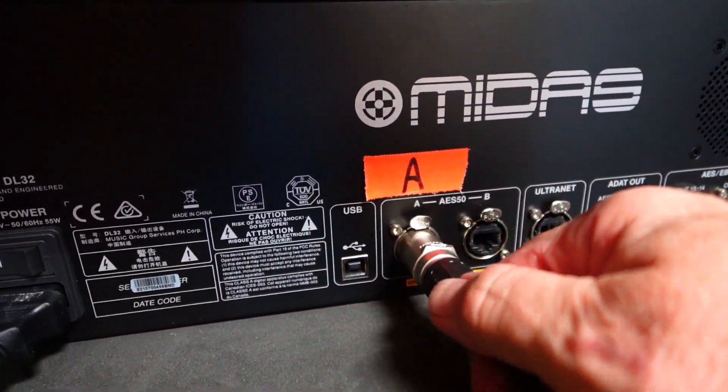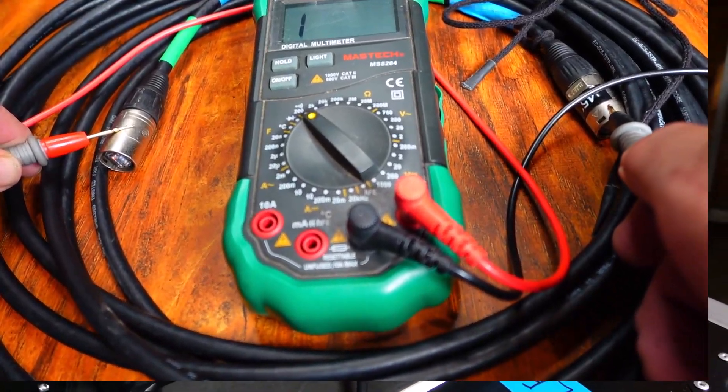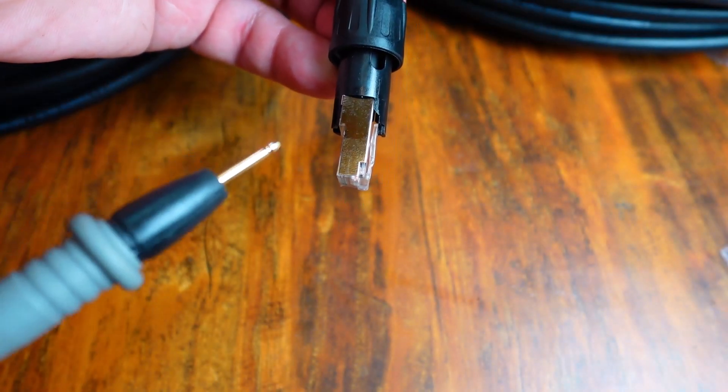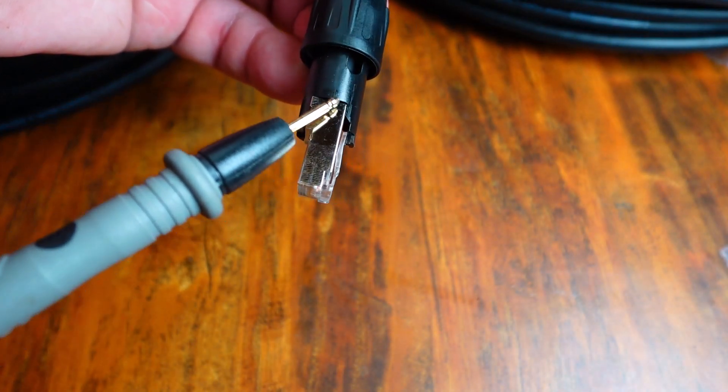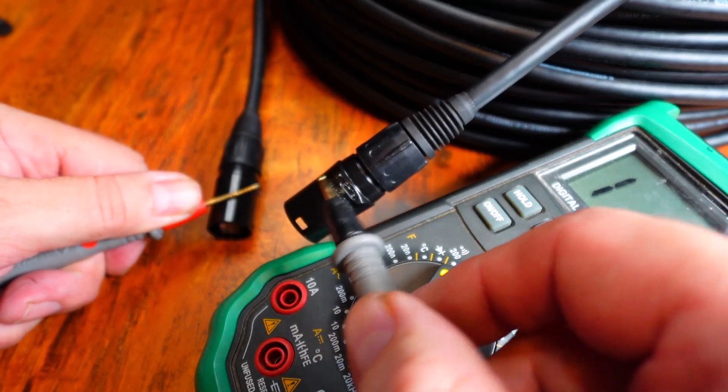The X32 ecosystem requires the shells to connect with the shielded ethernet cable, with continuity between the shells. Tests have shown that the surround of the RJ45 is not enough by itself. Protection from ESD — electrostatic discharge — is the reason. There cannot be continuity with the new black shells.